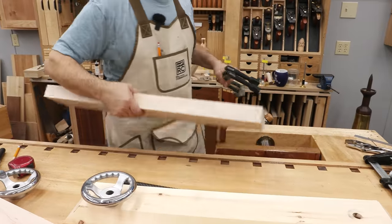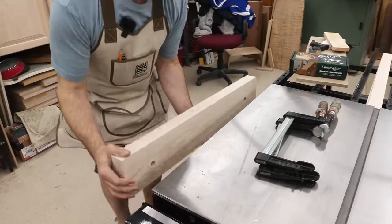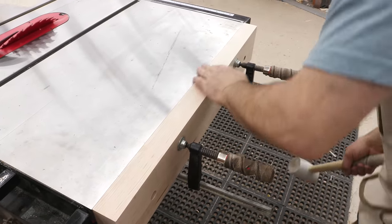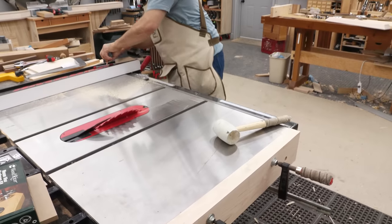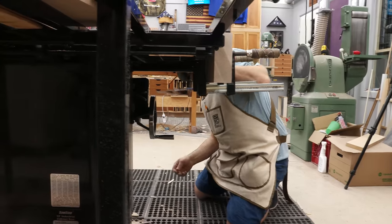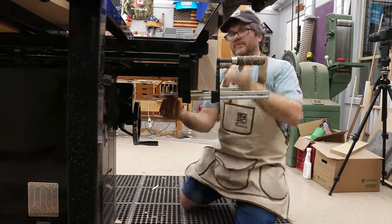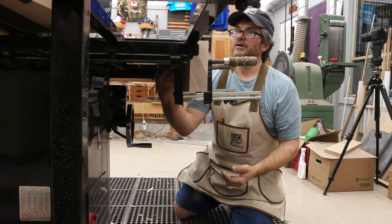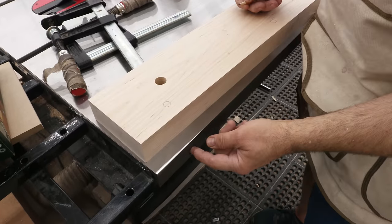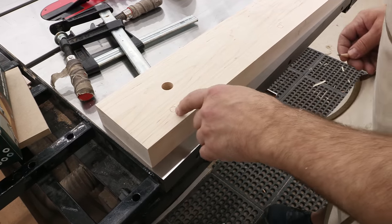Okay, now our next move is to get this in position. So we'll get a clamp. Okay, now I've cut a pencil really small, and I've got to get in there. Three will do it. It's not critical, but we want it to be as close as possible. So I'm going to find bolts that fit that hole the exact size, and then we're going to match this with the exact same size drill. So we should go in there and find those centers.